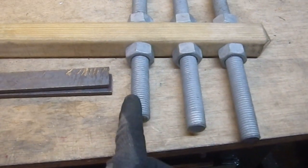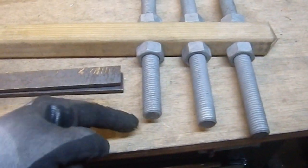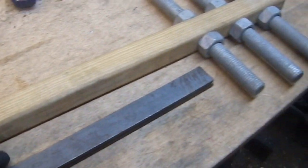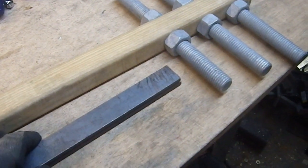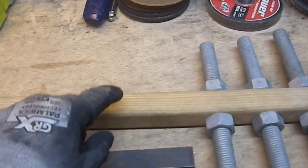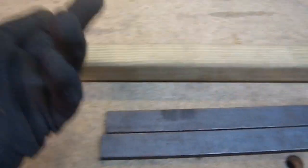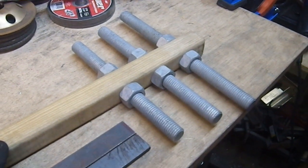The only advantage is because I'll be coming in here and cutting a wedge, I won't be cutting as much as I was here, which is going through the full thickness. So I'll cut the points on these, grind everything, make sure they're roughly the same length, and make sure the angles are the way I want them. As long as I get them the same on the facing side, you'll never notice if they're off by an eighth of an inch. My wiggle room is pretty big with these kinds of projects.